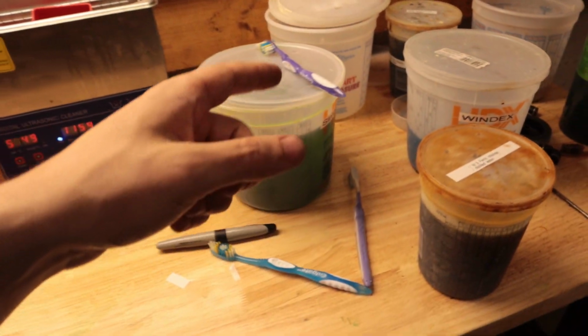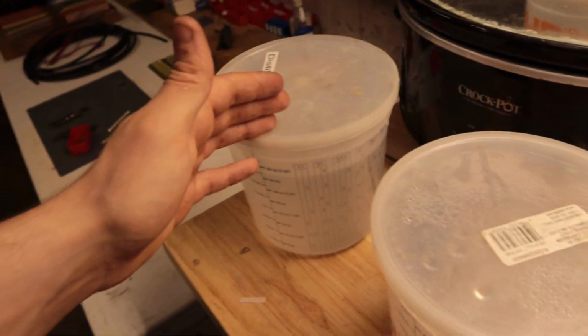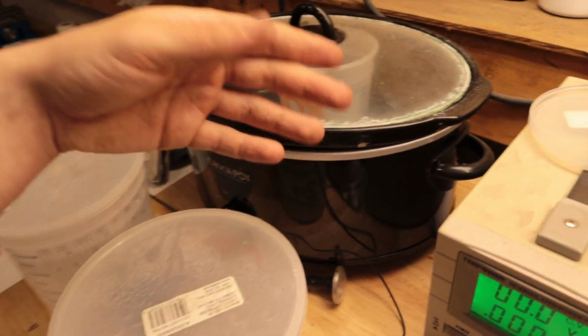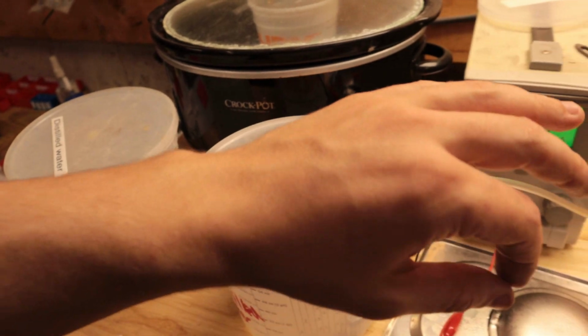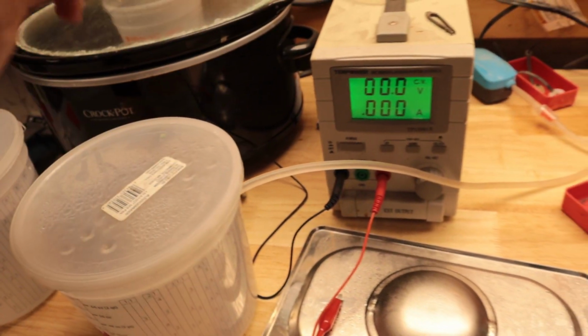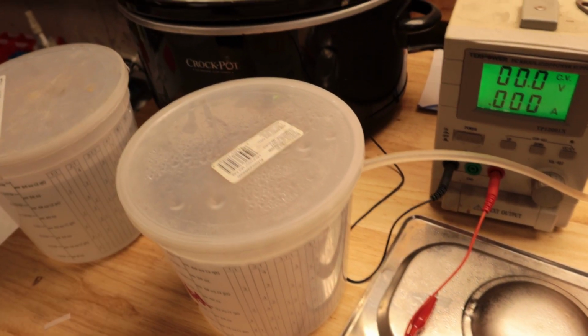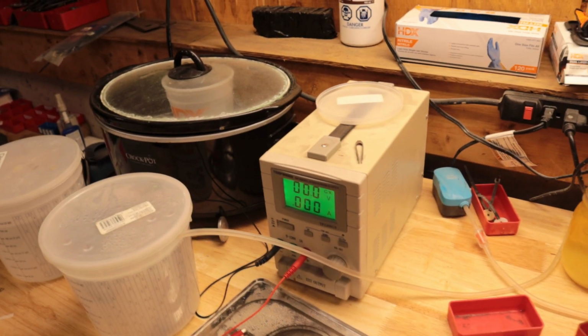Yay, rinse contamination. And then usually I'll have a clean rinse here, rinse it, then it'll go in there if I'm holding it, or it'll go straight into the etch for 10 seconds, and then dip it, you know, clean it again, and then come back to, don't clean it again, I just mean dip it in distilled water, and then go straight to anodizing in here. So yeah, that is the setup.